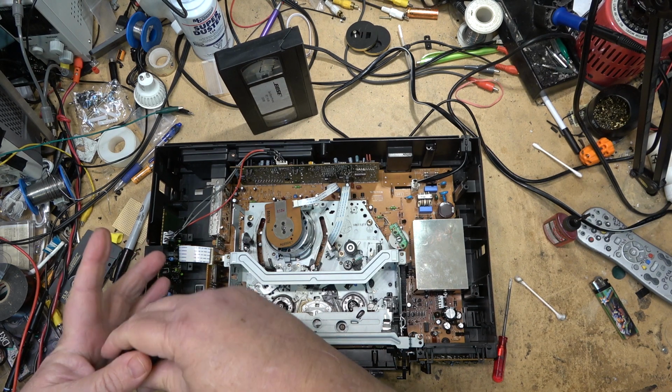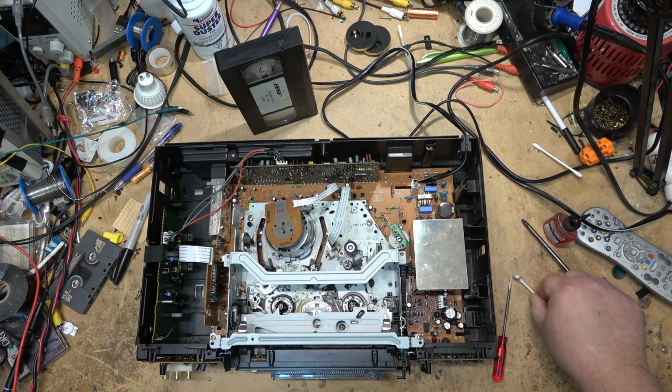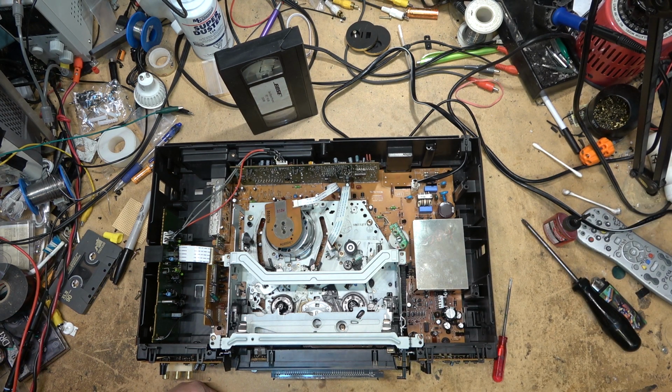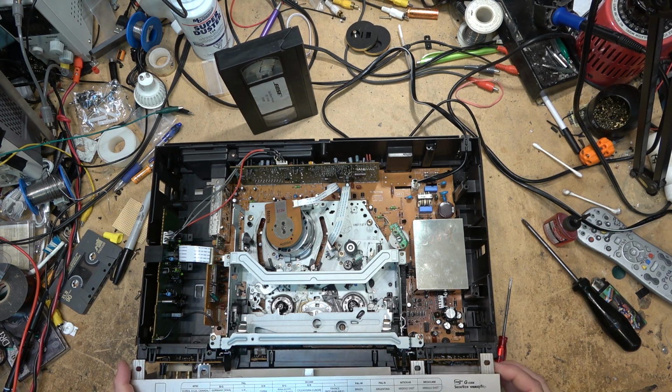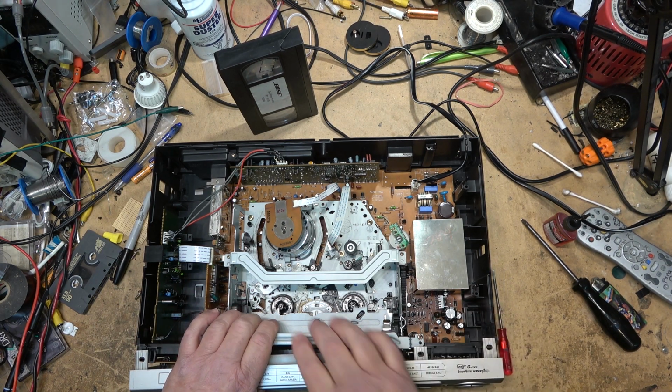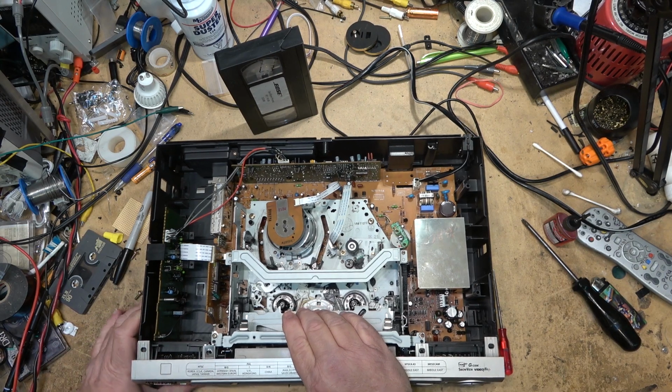So it's going to pop the front back on it, and then we'll test the machine. I bet it's going to work properly. Even though when I did try it, it did appear to work, except for the cassette didn't appear to be loaded properly, but that might have been just that tape. But from the description I got from the owner of it, where he had to actually remove the tape manually and help it out because it wouldn't eject, that's screaming mode switch all over.